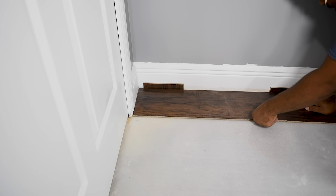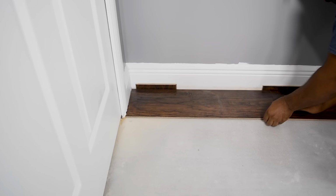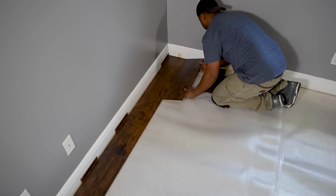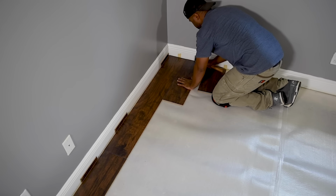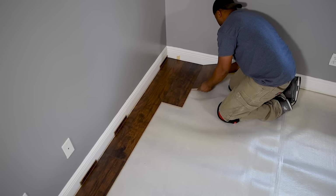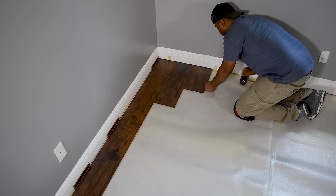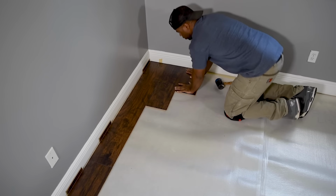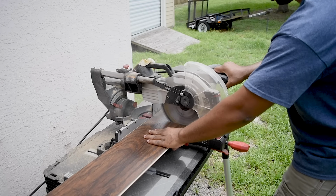Now that I have this all sorted out, I'm going to make sure I have the proper spacing going around the laminate flooring. So let me point out how I like to go about the first 3 rows of the plank, and then it's all repetitive from here on out. For the first row, I used an entire plank. For the second row, I went half of that, and for the third row, I went half of the second plank. If you want to carry that consistent look all the way out, you could, but it may take up more planks by just trying to keep a consistent design. If that's not that important to you, you can utilize the last cutoff plank to start the next row.